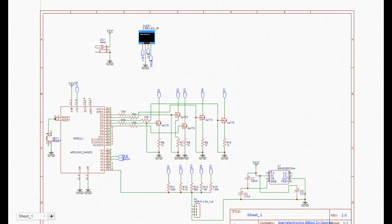Hey, what's happening guys. I don't know if a lot of you are going to remember this, but last year me, B-Blood, Dr. George, and a couple other guys were working on this project for the Arduino precision ohmmeter. It started out as a little exercise — a way to get an Arduino to read resistance. Since an Arduino can only read voltage, we obviously have to use Ohm's law, so we need to know the current and the voltage. If we know those two things, we can figure out the values. We put the original one together and it works okay.